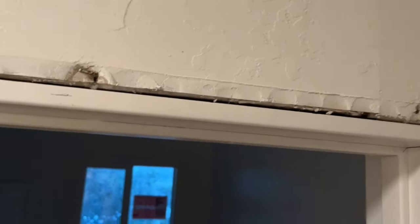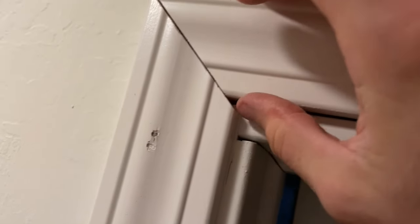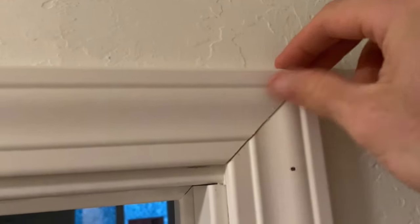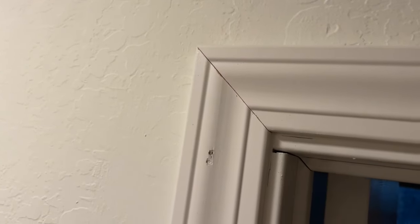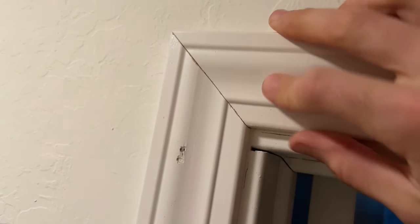This is the top piece of casing — as you can see it's too long. I'm going to keep cutting off just a tiny bit at a time until the other side sits nicely in place just like the first side does. After about two or three cuts, just taking off a couple millimeters each time, I'm pretty happy with both corners. Now I'm going to tack that in place and we're good.